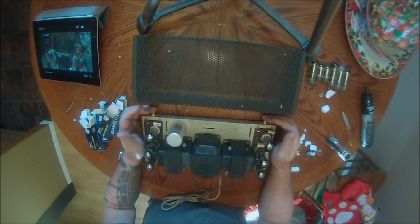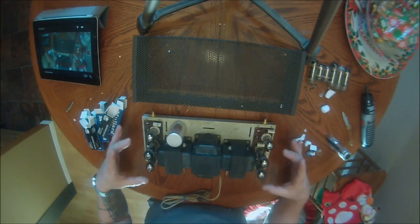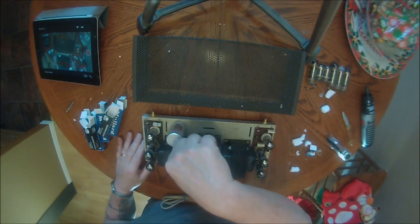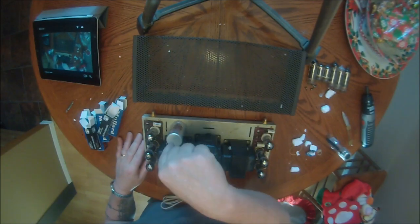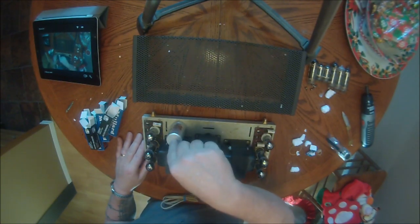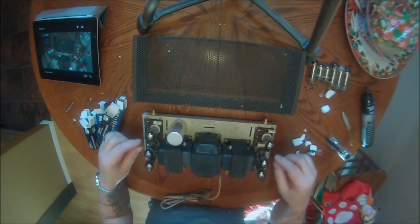On part 2, when I do the upgrades, I'll go over the specifications of the amplifier from the factory, and when I get more familiar with the components that are in there, we can maybe see how they might have changed the sound of it. It's been kept to the original circuit design, so there haven't been major circuit changes. You can buy boards for bias adjustments and stuff like that. This is the can cap. The only modification really to the circuit was the diodes. The solid state rectifier got new diodes. The can has 4 capacitor sections, and one section has been replaced with an external capacitor, and the caps on the top have been changed, along with resistors. So it's been updated sometime in its life, which is to be expected since it's 48 years old.